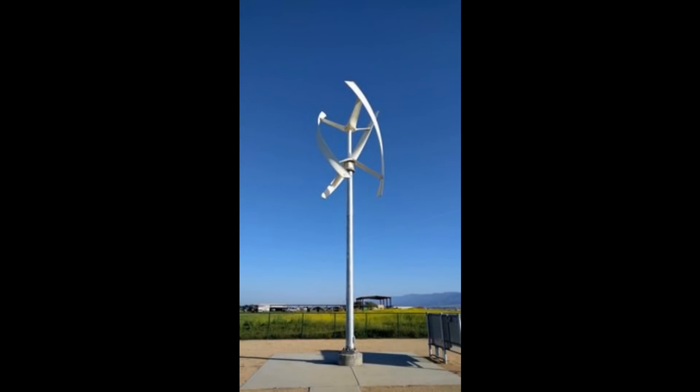You find these things made in a whole variety of forms, but they all have their own advantages and disadvantages. The Darrieus type turbine is actually very much cheaper to make because you don't need a big concrete tower — you can hold it down with guy ropes, which you can't do with a conventional turbine because the blades extend above and below the tower.